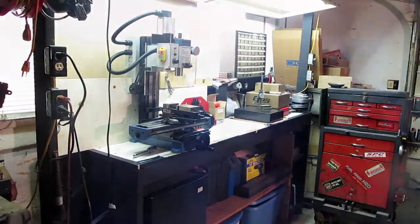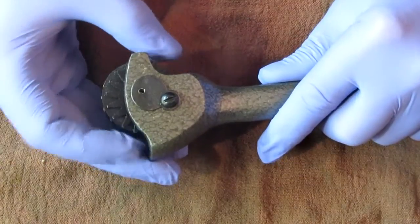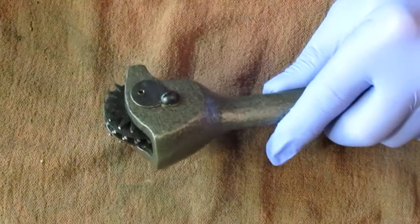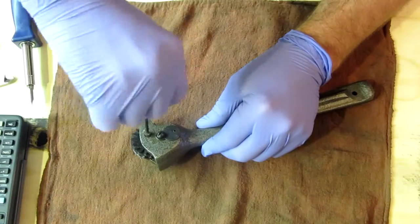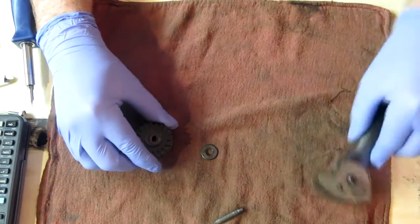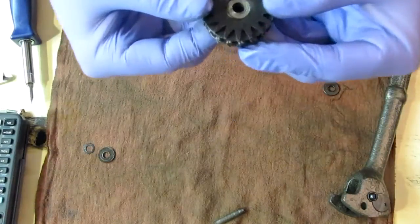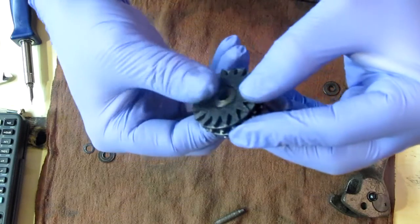So what exactly is going on here? If you look at this star wheel, it's moving off center and turning around and getting jammed up. So we got to find out what's going on in there. That bushing's just a few crackers short of a full pack, for sure. That star wheel is just barely hanging on there. Alright, I guess we're making a new bushing.